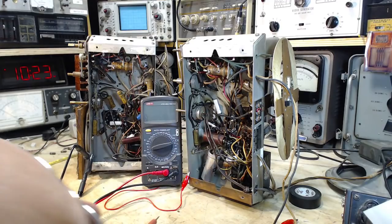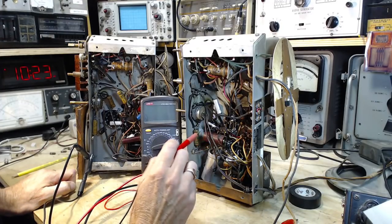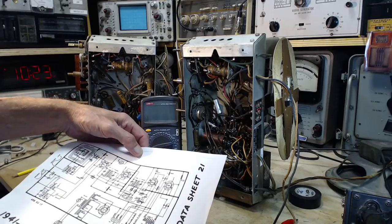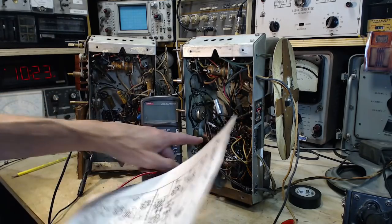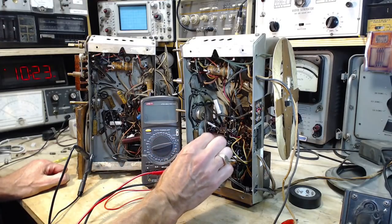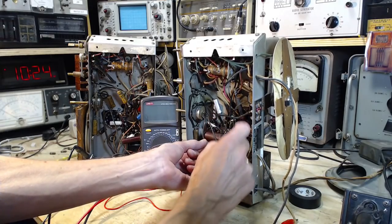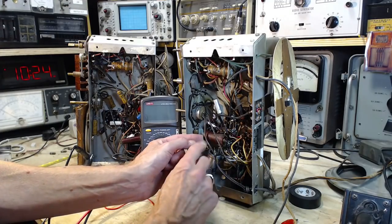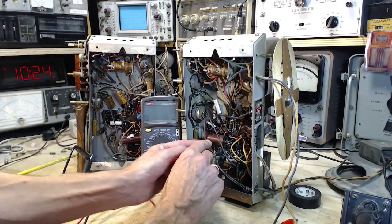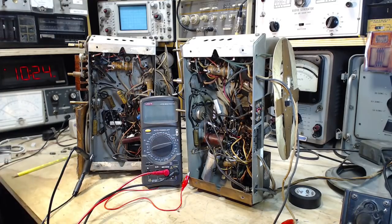So we come around to 5. 1, 2, 3, 4. Well, 5 has this great big honker on it. 0.02. This must be a 0.02 capacitor. Now this looks more like the right size for 0.02. This looks crazy. I'm going to replace it anyway, so let's monkey around with it here. DC working volts, 1,000. I think that's the reason this is a big capacitor. It's 1,000 working volts. There it is there. 0.01. This, well, it could say 0.02. Hard to see. So that's what's happening there.